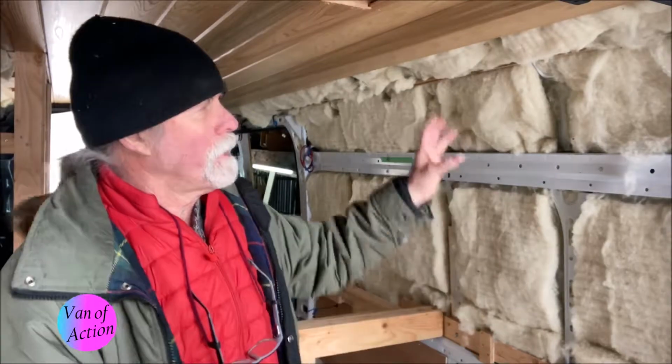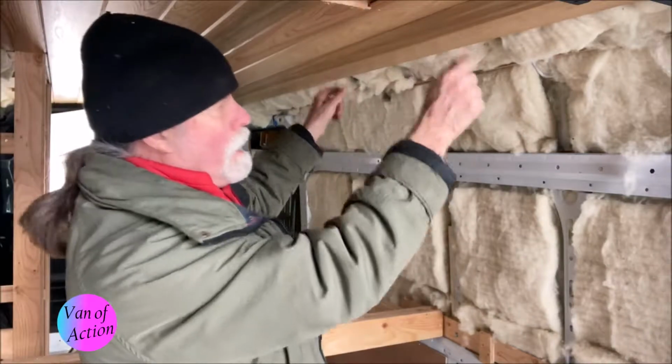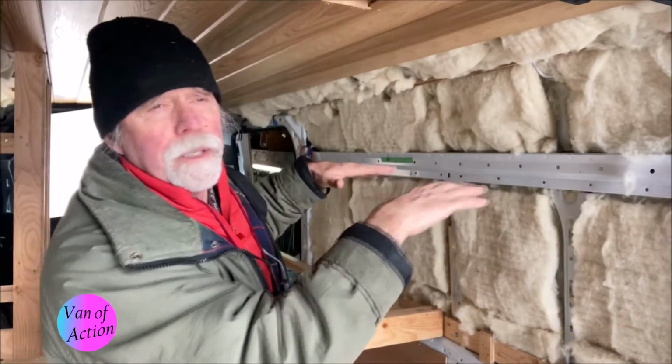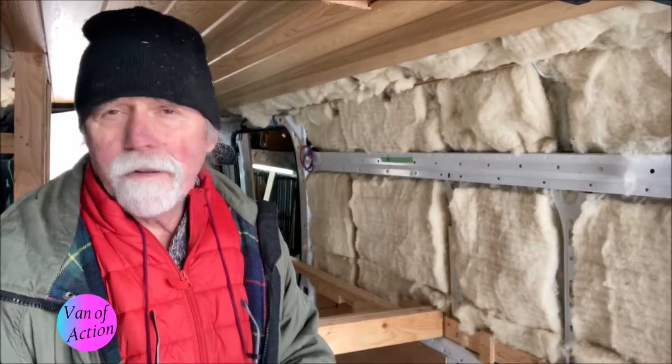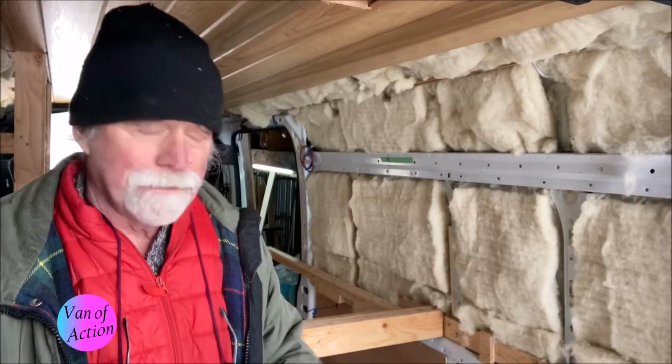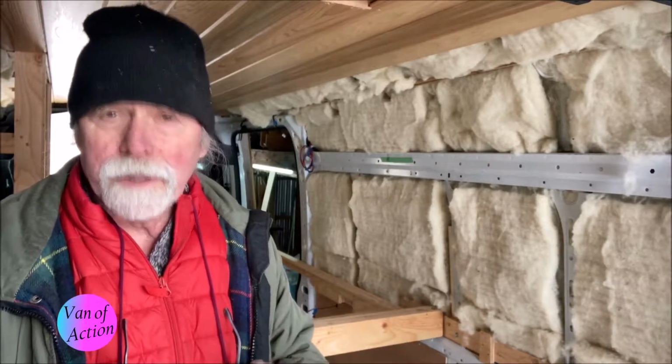And by their nature, these upper cupboards are really flimsy. They've just got a couple of little sticks holding all the weight. And as you drive down the highway, that's going to be shaking. You've got to be careful. A lot of folks you see online build with solid wood, either 1x2s or 2x2s. To me, over time, that's a mistake.